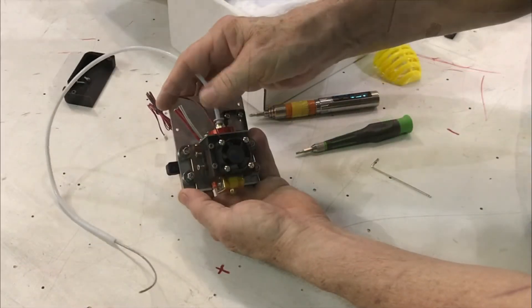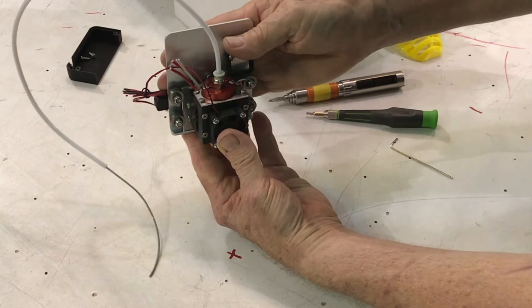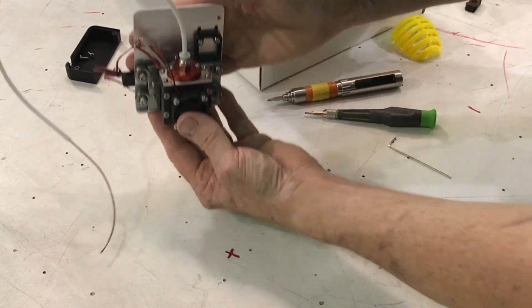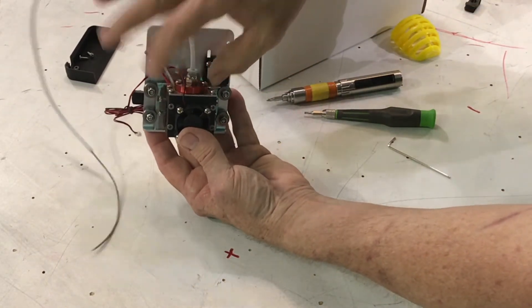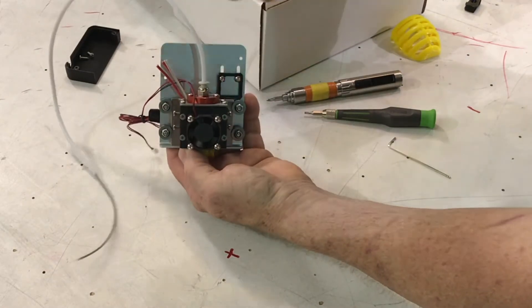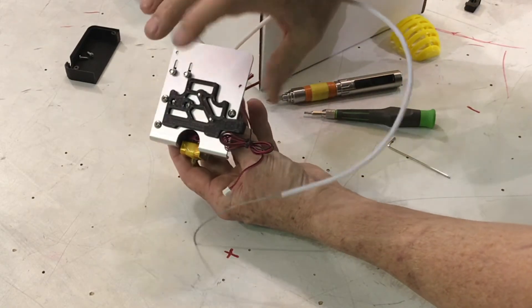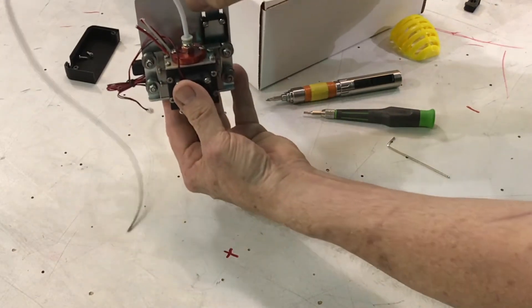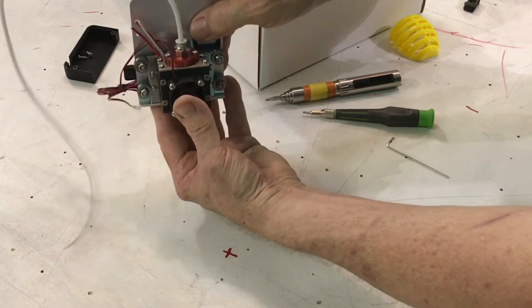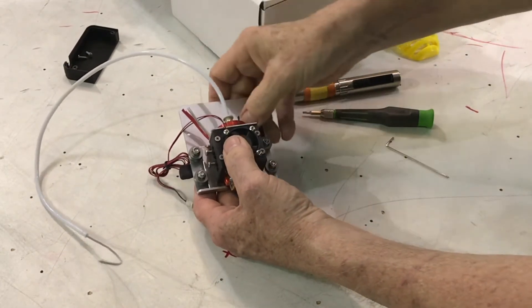You're done. This would be a good time to mention that the backing plate actually bolts to your CR10 before you start putting this part in — it's a lot easier that way. In fact it's actually necessary because there are some screws you have to get to from behind. The screws come already stubbed out and captive behind the plate. You put this up against your CR10 after taking the stock hot end apart, and the screws go right into the stock holes. It's a real simple installation.